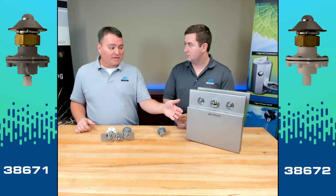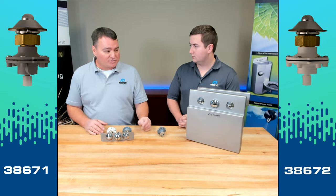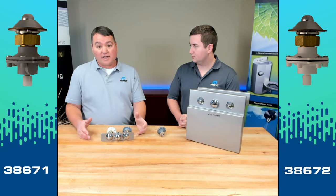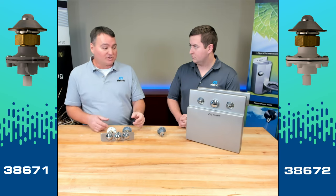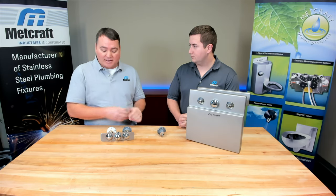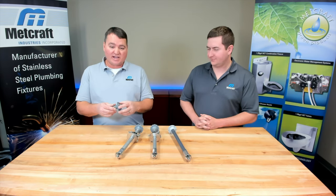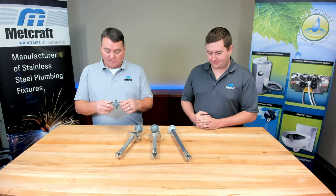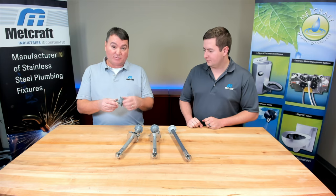On the backsplash mount — which in certain situations we call a front mount combi — we would mount the push buttons in the body. They're designed to go on a vertical plane, whereas the deck mount is designed to go on a horizontal plane. Sometimes you don't have enough room behind the fixture or enough room to attach the pod actuator to the back of the push button.